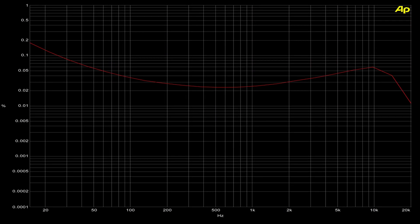This curve shows the distortion and noise of this device in straight pass-through mode without the speaker emulation turned on, and it looks quite impressive. The distortion figure is better than 0.05% across most of the audio spectrum. I consider that to be excellent audio performance — it should pass your signal through without any frequency response changes, with no frequency areas getting accentuated or diminished, and the distortion is vanishingly low. Whatever you put into the input should come out very clean and clear without any modification whatsoever.